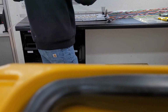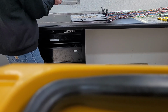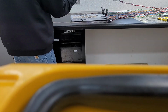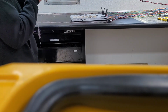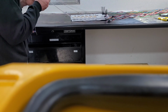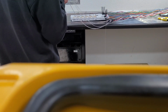Like I said, fiber's finicky, it can be very deceiving. Everything can look and appear fine, and then you go to splice it, or you go to fasten it in, and boom, you find a bunch of stuff that just did not show itself to you before. Do the same thing here. I feel a kind of roughness in this, and I shouldn't feel a roughness. So, one thing I'm going to look for is there's probably strings that I missed. Yeah, see, that's a string. So, you shouldn't feel it, it should all be smooth. So it looks like I missed two strings.